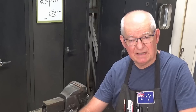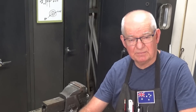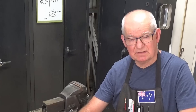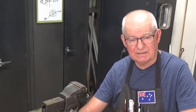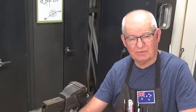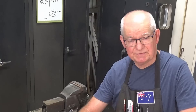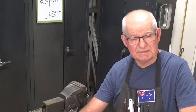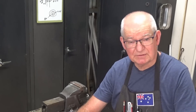I needed to make some parts that had features on them that you would normally carry out on a milling machine — things like flats on shafts and squares and hexagons and so on. It's a little accessory that mounts on the compound slide of your lathe and you can duplicate those features on a metal lathe with a high degree of accuracy.